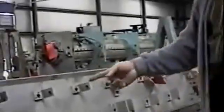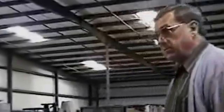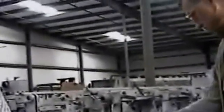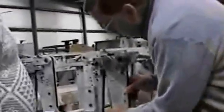Here's a framing fixture for one of the elevator or rudder, possibly. The frame is honeycomb ribs and a tubular frame. It's bonded together, assembled, paste adhesive injected, shoved into the oven. Then the skin goes on in a separate operation in a fixture like this. The frame is located by this shaft, and the pressure applied to the skin by air pressure. See the silicone air hoses?